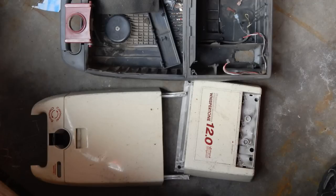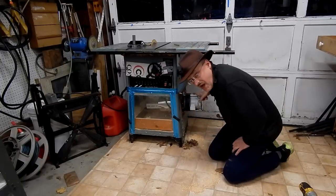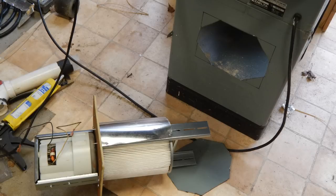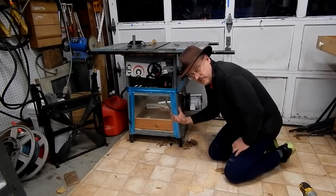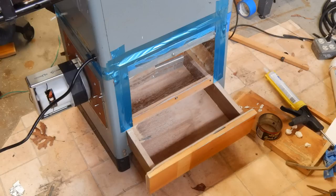The change that I made is I extracted the vacuum motor from a Sears-Kenmore canister vacuum and attached it to the side of the table saw. I cut a hole in the side and bumped the steel panel. Inside I attached a shop vac filter, and then I built this drawer assembly so that I could empty it out.